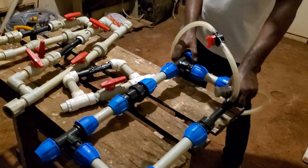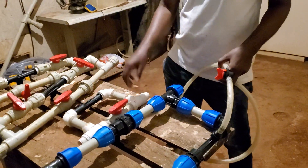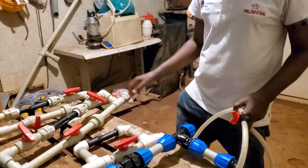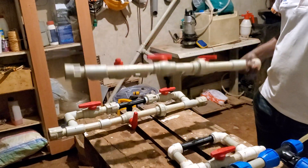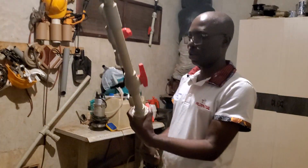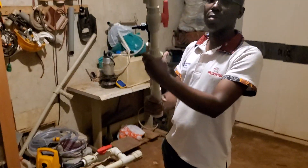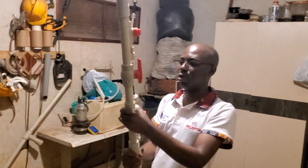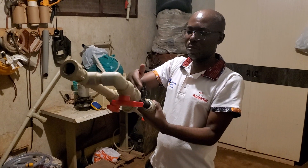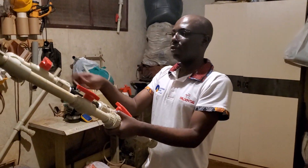These are the different ways you can connect your Venturi system — using HDPE, PVC, or PPR. Make sure that when you use this method of connection, you put a mechanism here where you can open it, in case it gets blocked or you need to change it.